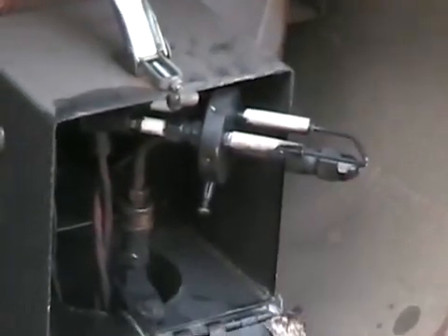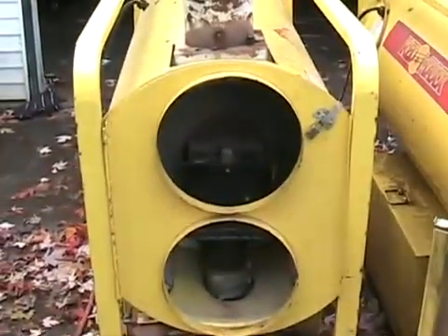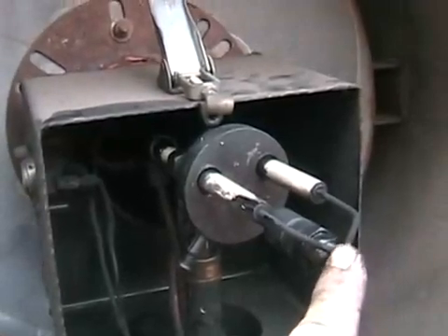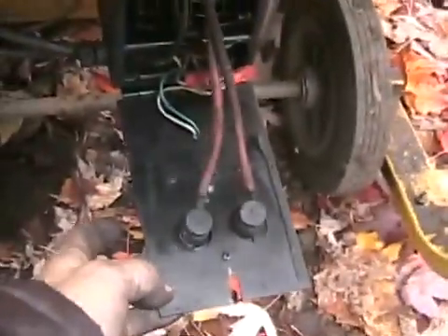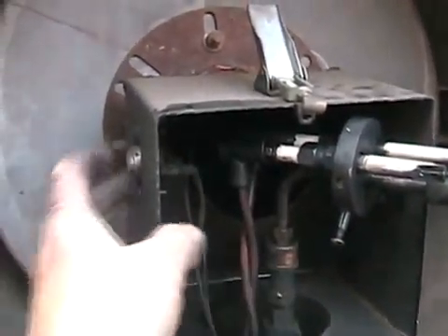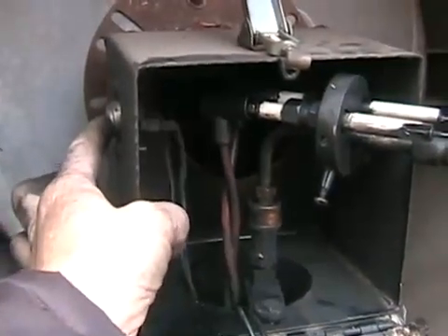That part there is actually pointing backwards — it's supposed to be pointing inside the combustion chamber, like the one on this. These two white bars are ceramic insulators, like on a spark plug. These are your two electrodes. The high voltage spark jumps between them to keep the flame always going. Just two high tension spark plug wires going to it, and this is the other side of your high voltage transformer. Here we have a safety thermostat in case the exhaust is blocked or the fire backwashes and comes into the combustion box, so it doesn't catch everything on fire and destroy it. This thermostat shuts the unit down if it gets too hot.